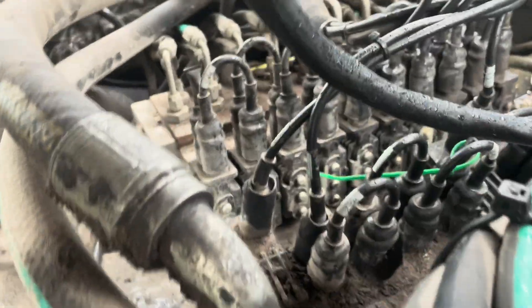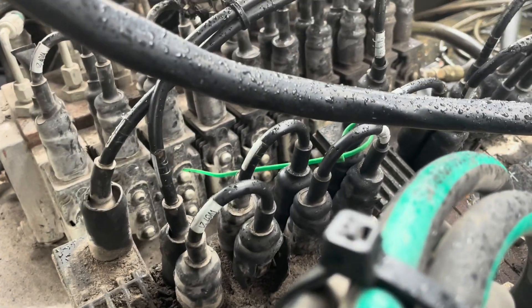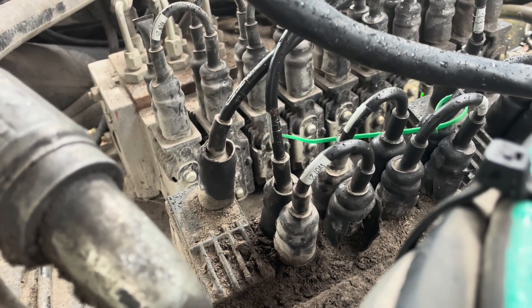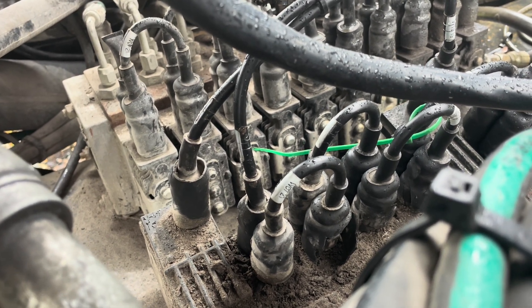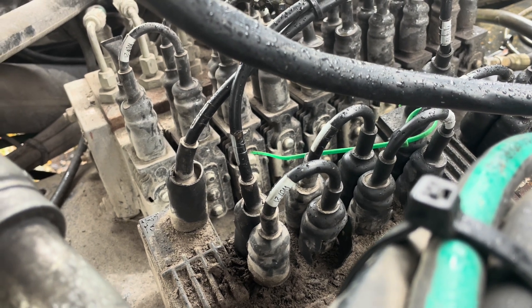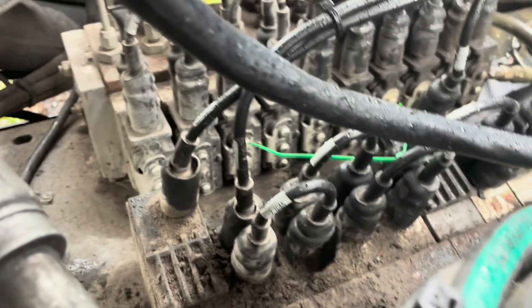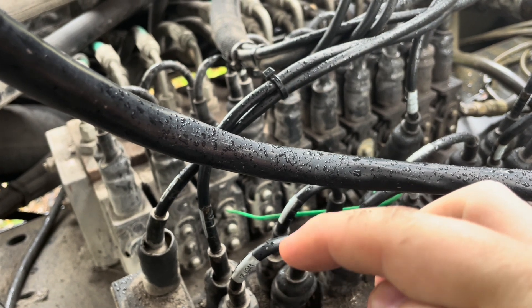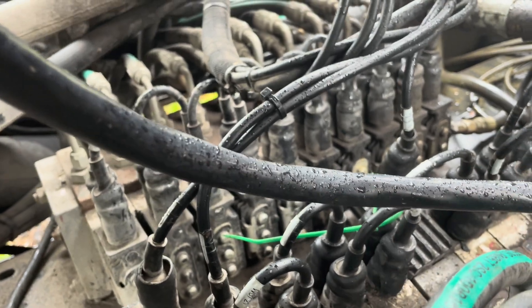What I'm going to do is go to the last one that I know is working and jump wire from it further down the line, taking some of these coils out of the equation to see what is and what isn't working. We'll basically make one thing work at a time. So I'm going to unplug this wire, move it into here, test this one individual function, and then move my way down the line with that one wire until we see exactly what is and what is not working.